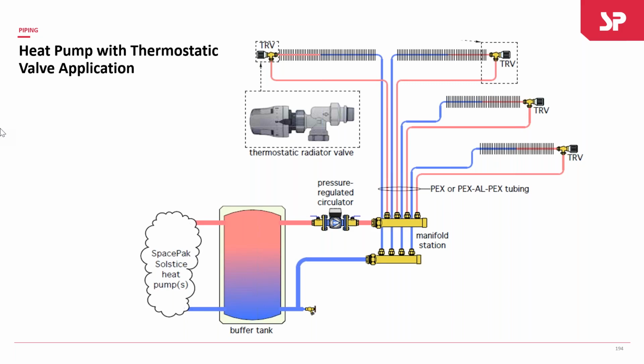If we're not flowing enough water or water glycol, we're not going to have enough BTUs traveling. I urge you all the time, if you're putting in emitters, look at the chart. They will absolutely have one, or something similar, that says at 120 degree water and 2 gallons a minute of flow, I'm going to get X amount of BTUs. If I take 120 degree water and pump it at 4 or 5 gallons a minute, I'm going to get far more BTUs out of that same temperature water just because I'm flowing more of it. That's how we get our BTUs. More flow equals more BTUs, period.